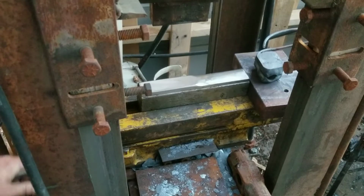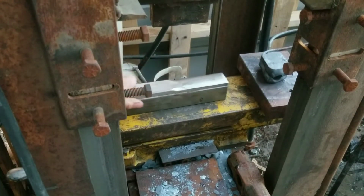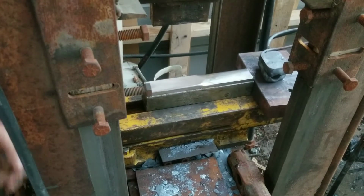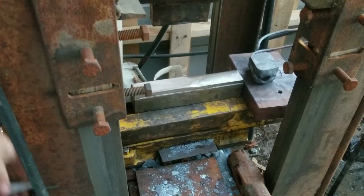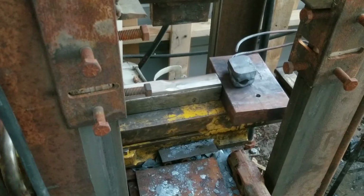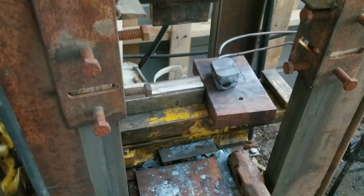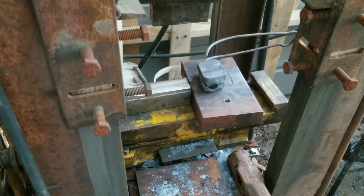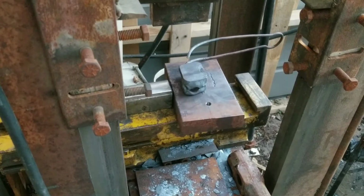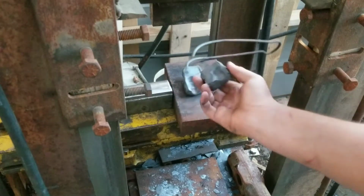Now, forging dies are on the press. On the cross slide at least. They're not quite mounted yet, but they fit. And now I can sit there and switch between combo die, or between rounding dies and flat dies without an issue. And there's enough room on this cross slide to move all the way over to a spring swage for closed die work, or whatever I want all the way over here.